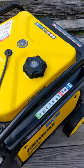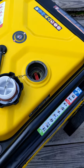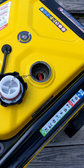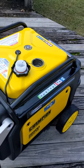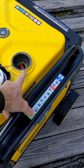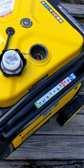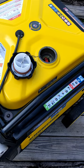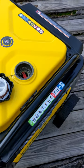But the biggest problem to me is this fuel fill. If you try to fill it with a five-gallon fuel can, fuel is going to splash out and go everywhere — the filter and fill hole is just too small. The only way to fill a generator with a big five-gallon can is to rest the fill spout on the lip and let the fuel flow in, but today's EPA-approved fuel cans are all-or-nothing. Most of that fuel hits that lip and the indicator and splashes out.